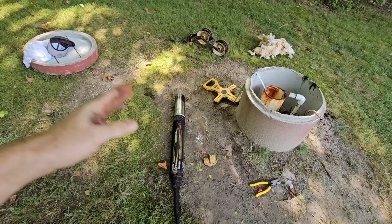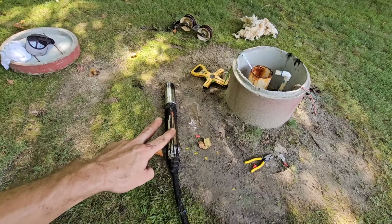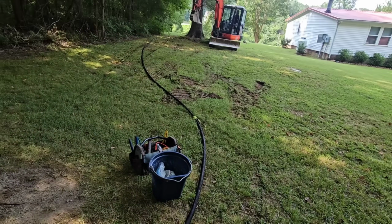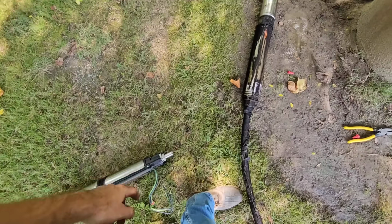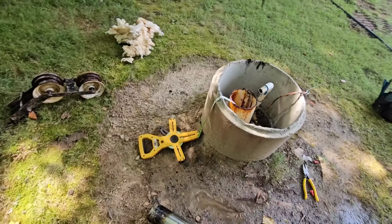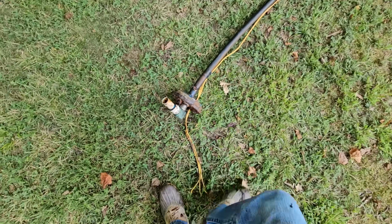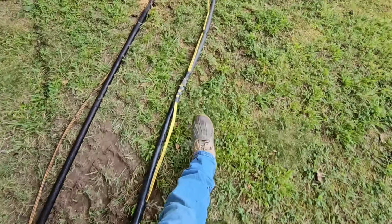But for right now, we're going to cut 15 foot off the pipe. We're going to try to save the pipe and the wire as long as the wire looks good. I'll clean up this section, and then I'll take the 30 minute journey and inspect the wire very carefully, and we'll put this pump on. Lots to do. Okay, we're going to do away with this rusted piece of crap. Let's count. 1, 2, 3, 4, 5.